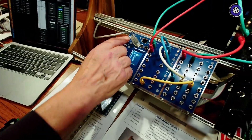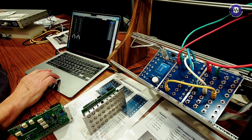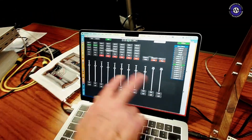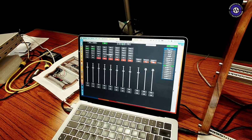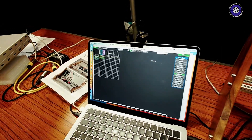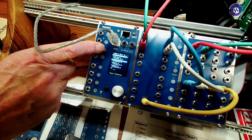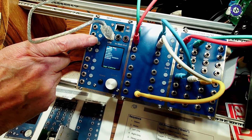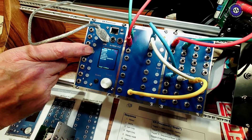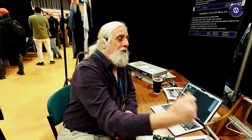So let me show you what you can do — a simple way of seeing what's going on. There's the mic amp module; you can see there are two. This is the gain module and this is a representation of what's inside. We're interested today in the matrix here. You can hear this is stereo. If I push on this trigger input here — simulating a trigger by pushing the switch — it will reset to the first event in the sequence. The next event will switch this to mono, then pressing again goes to left channel only, then right channel. So they're kind of recalls effectively. Yes, that's effectively the recall. There are 128 snapshot memories for each, and that's 15 modules wide.